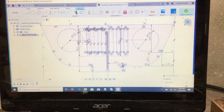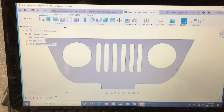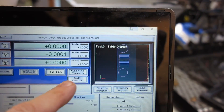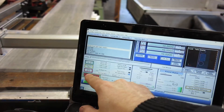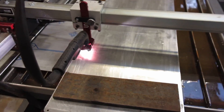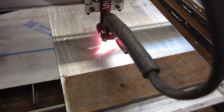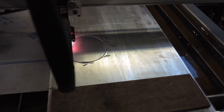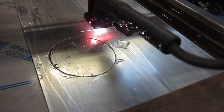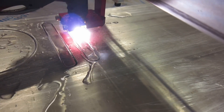Here's a quick shot of Fusion 360 with all the dimensions of the grill. One quick tip with Fusion 360 is using construction lines and mirroring your work. I pretty much drew half the grill and was able to mirror the other half once I got all my dimensions right. It saves you a lot of time. This is the five inch hole for the headlight. I roughed out the basic shape of the grill, fine-tuned one side, and mirrored all the parts to the other side.